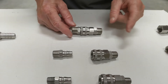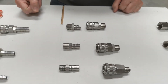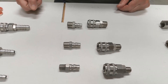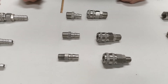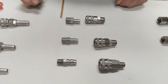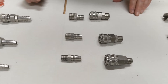They come in quarter, three-eighth, and half inch BSP male connections on both ends. They're 304 stainless steel, suitable for water and air — particularly good for air that has water in it and may be slightly acidic, whereas plated steel ones will corrode in that situation. The coupler doesn't vary in size, it's just the thread.